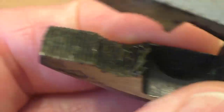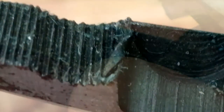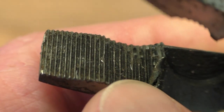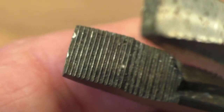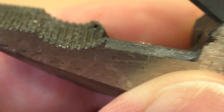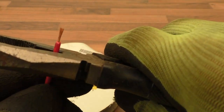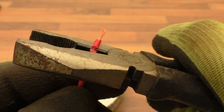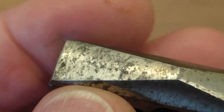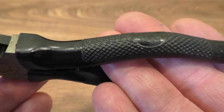If you have a look in the jaws here, you can see there is still a roll of excess metal where they have machined out in here — it's still there. You've got no damage to the jaws at all; you can still see the black in there. Again there is another bit of roll-over just there from the machining. When I got these home I did do some cutting tests, so you can see there is a little bit of copper in there. There is a slight bit of rusting on the tips, but nothing to worry about — they are in such beautiful condition. And the handles are exactly the same.